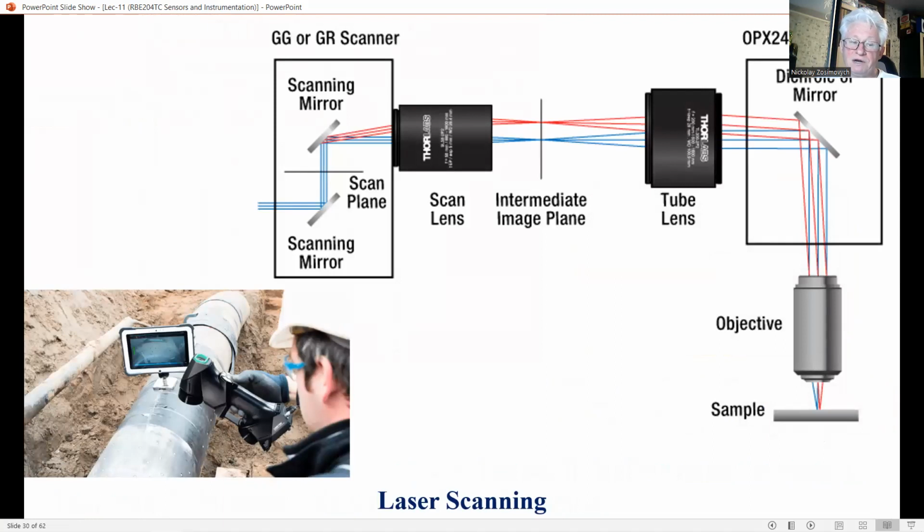Mechanical scanning is relatively slow and forms the major limitation of the acquisition time, in particular for a 2D scanning mechanism. Line projection using cylindrical optics considerably reduces the acquisition time and is therefore widespread in range finding systems. One solution to speed up scanning of the other dimension is an array of transmitters sending a set of parallel lines to the object under test. The resolution is limited by the number of transmitters, which for practical reasons cannot be very high. This solution is only suitable in cases where no high resolution in the scanning direction is required.